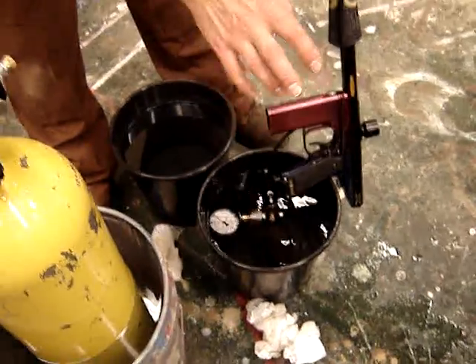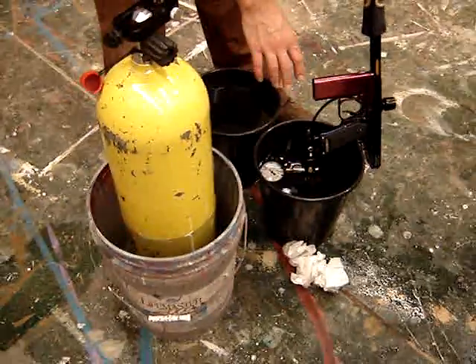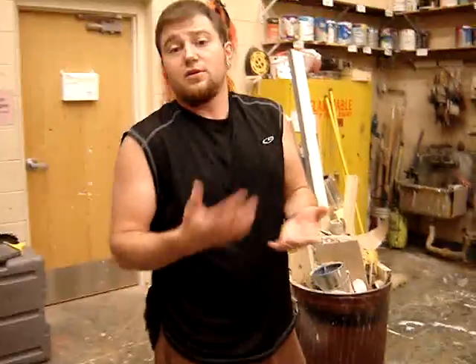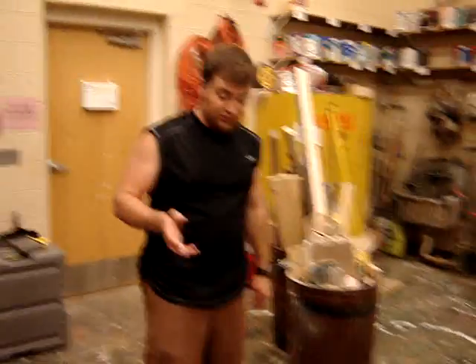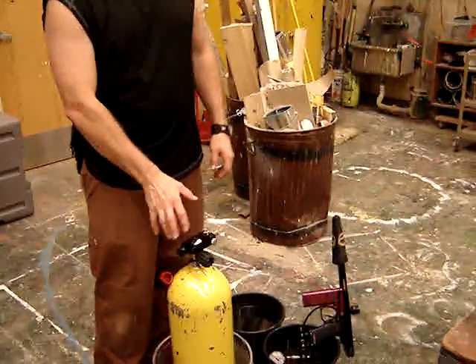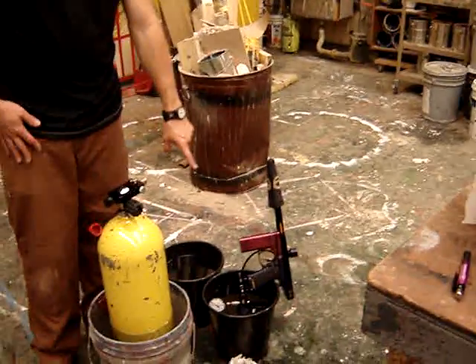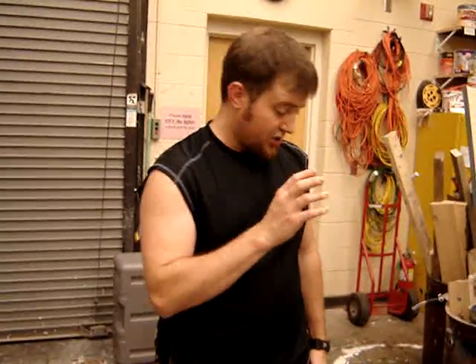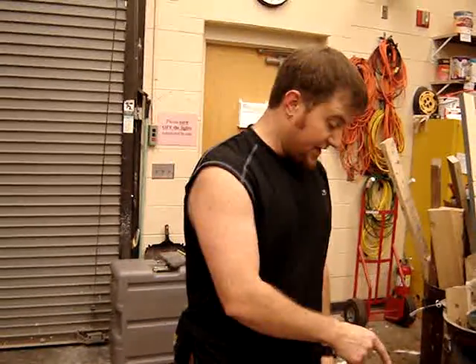We're cooling the tank down to room temperature — this water has been sitting here for a long time — after each fill, to make sure we're starting with the same conditions. Obviously increasing the temperature increases pressure. We're keeping this water bath constant; it's a big enough tank so it's not changing much, but the little guy changes a lot. What we're doing is filling up to about 2,150 psi. As it cools down, that gets us right at about 2,000 or just a few psi over. When we're shooting down to 2,000, we start counting shots in 10-shot groups, shooting down until the gauge hits 1,000 psi. So we're shooting 1,000 pounds of pressure out of that small tank.